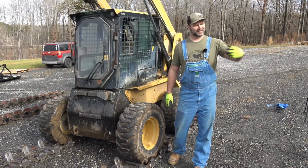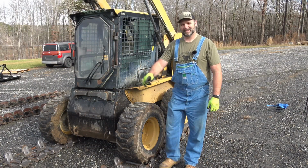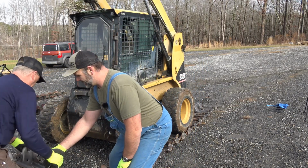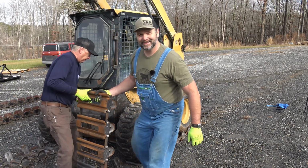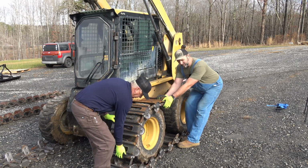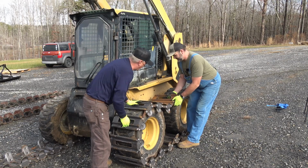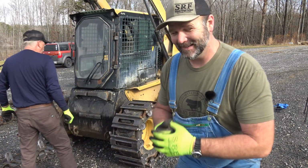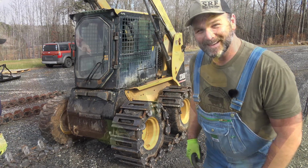So next step, Cousin Vic's gonna come over here. He's gonna grab this side of the track and we're gonna lay it up on here. You grab one side, I'll grab the other if you want. That way both of our backs don't get hurt. I've been down in my back already. We're gonna pull her a little tight. Okay, good. Let it kind of hang. We just learned something, both of us. Take your bolts out before you get ready to lay them up on there.